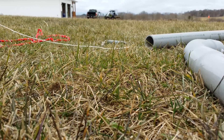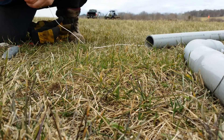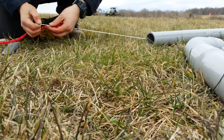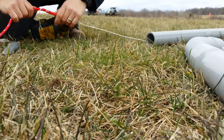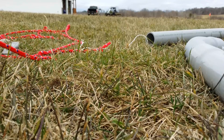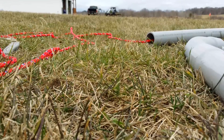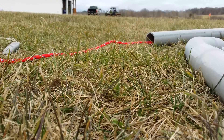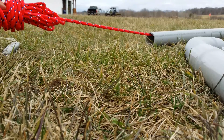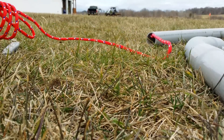With this light little string, you turn on the shop vac and it just flies right in. Pretty soon you've got the string at the other end and nobody had to work at it. Now, since the string isn't actually strong enough to pull our big heavy cable through, we're going to tie the string to a strong rope, pull the rope through, and then we'll be able to pull that wire through with the rope. It may seem like a lot of steps, but it's much easier than just trying to feed that wire through conduit. If it hits a bump, that wire's going to get stuck. If you have a rope on it, you can really get a good tug and get that wire through.